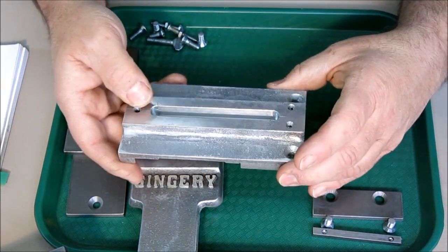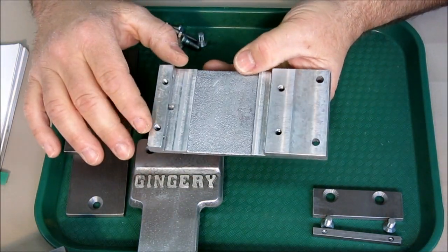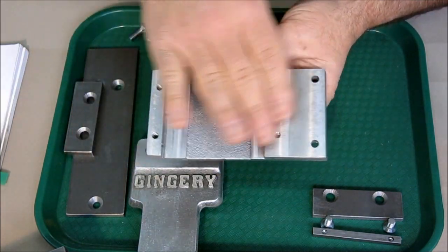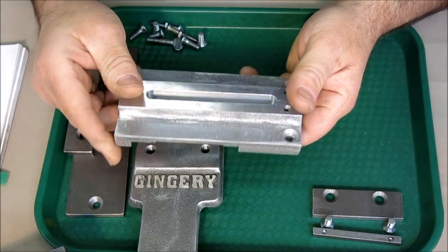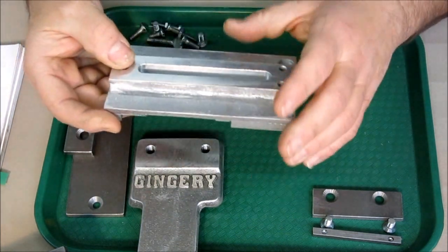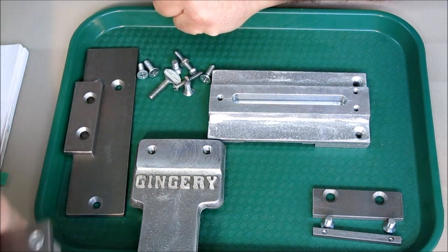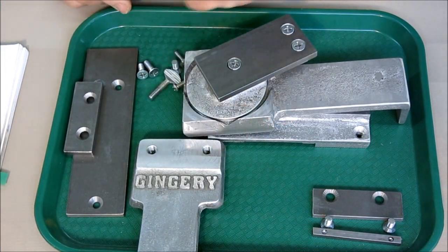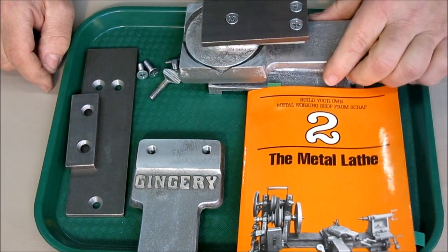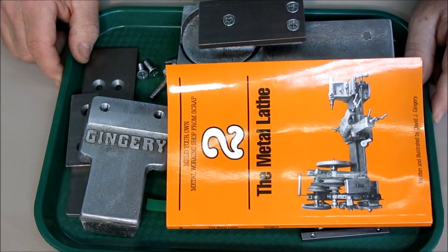And then here's the last one. This one needed the most work here. Chris had scraped these surfaces but was having a hard time. So what we did was we just went back in there and dusted this off so it's all parallel and nice, and then did this surface and then did this big slot here. So anyway, that's it, and he can reassemble all this, and he probably wants to mess around with it himself. So those are the castings, and thanks, Chris, for a neat little project. He's actually coming over to pick these up, so we get to meet him in person.